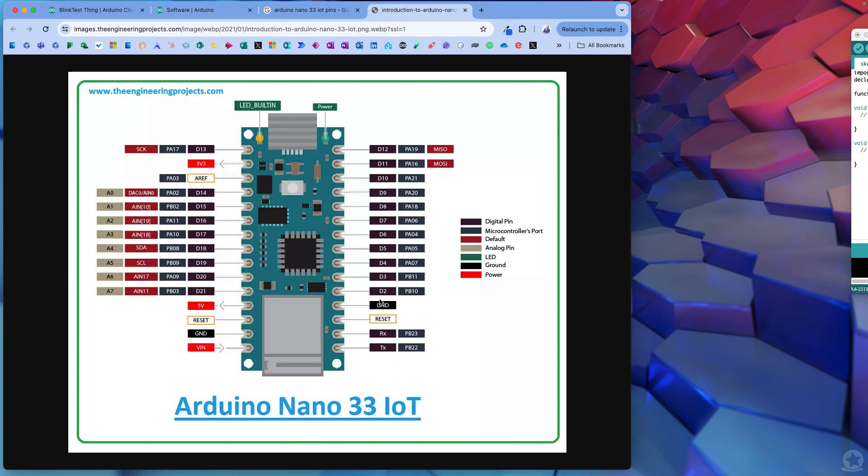What I like about the Arduino is these little white areas here and here which depict the ground, which is very important. When I flip it over it will be on the opposite side, but you can also read inside the board - it actually has the pin numbers themselves. I'm going to plug into ground and D2, which are side by side. If you're counting your pins, it's the fourth and fifth pin on this side. I've got my ground in the white one there and I plug into D2.